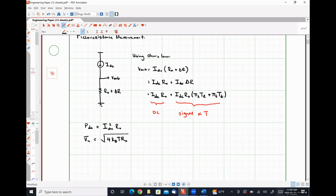So while this type of resistance measurement scheme is useful in some applications, there are some disadvantages to it. Because the change in resistance may be very small, it might be necessary for us to amplify things. Well, right now, our signal resistance, that small portion that's proportional to our applied stress, and our DC offset are effectively linked together. So we can't amplify just the small signal. We would also wind up amplifying that DC level as well. And that is problematic because it would require supply voltages for our amplifier to potentially up to hundreds of volts in order to make that work, which is not going to be acceptable for a small scale system.